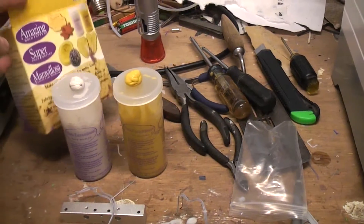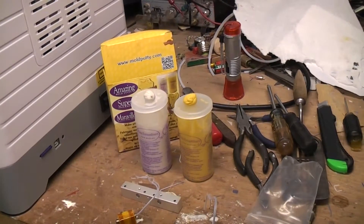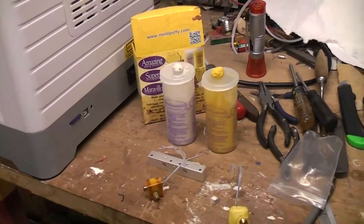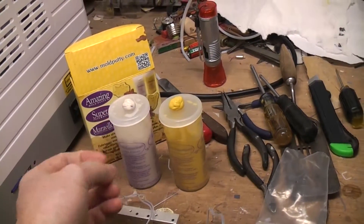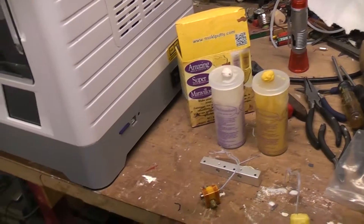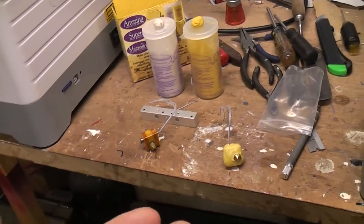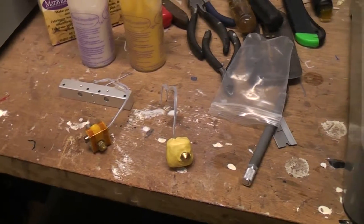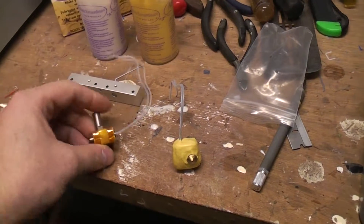This is cheap stuff that you can buy at any hobby store, online, in smaller or bigger amounts. I've also used Smooth-On stuff and the Silpax Silputty — I've used silicon putties for over 25 years. You take out equal amounts of Part A and Part B, which are color-coded so you know when they're mixed equally. Mix them together in your hand — it feels just like silly putty or a soft clay. Mix until it's a uniform color, then smear it around whatever object. In this case we're just encapsulating a hot end — put it around it, and don't worry because it's not going to stick. You can yank it off or cut it really easily with a razor blade.